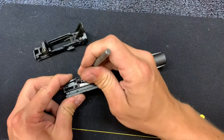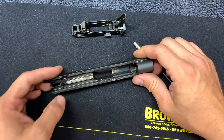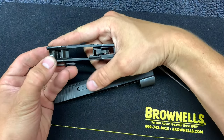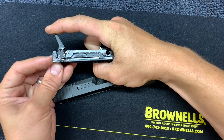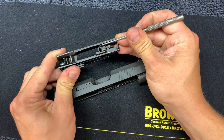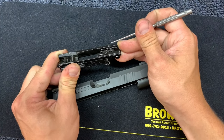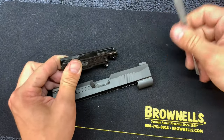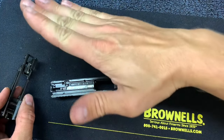So how is that plunger being depressed while you're firing? In its standard state, it is not. That first section of your trigger pull — the stage before you get to that 90-degree break — as you pull the trigger through that first stage, you're going to see a little lever rise up. That's from that first stage. Then you go all the way and you can see where the sear is pulled down out of the way. So that first stage is what's depressing the firing pin safety — that's where the lever sits and pushes up to hit it.